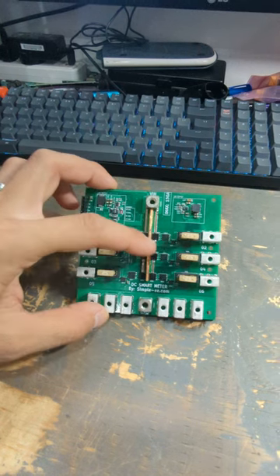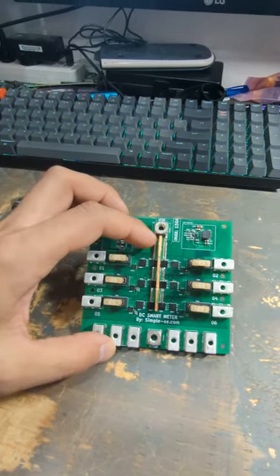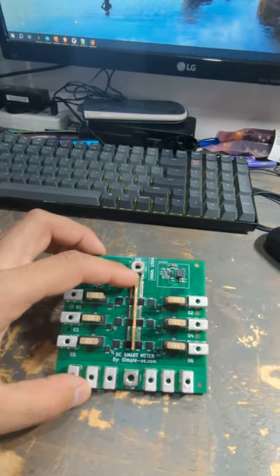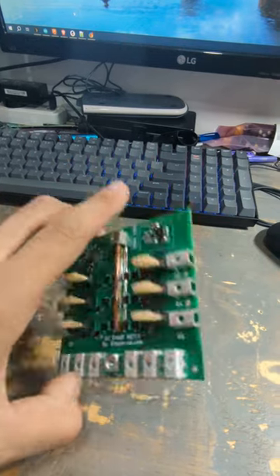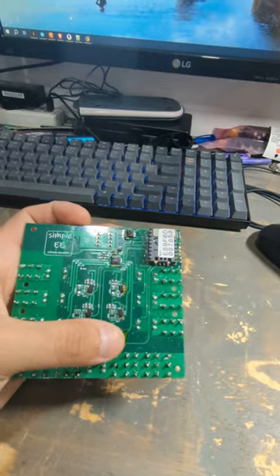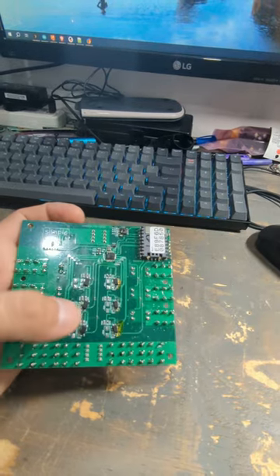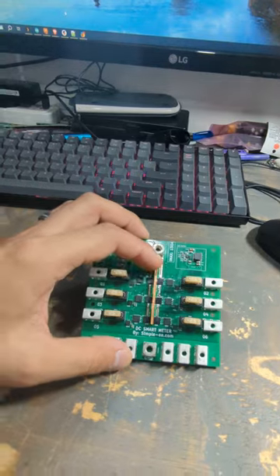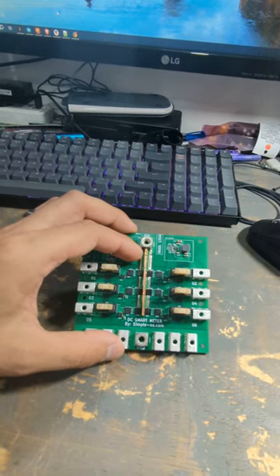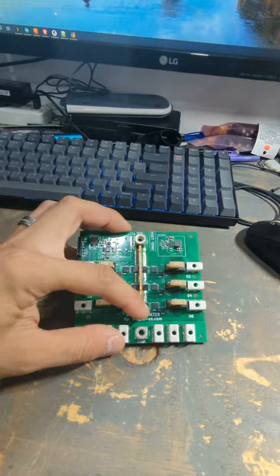I'm still working on this main leg — I did a copper bus bar but I'm working on calculating how wide and how many layers it needs. Right now this is only a four-layer board and only the top layer is using the power bus since I have circuits underneath. You can see some parts here that don't match the footprint — that footprint section will be gone, which frees up space. There's a chance I'll be able to add all four layers of copper pour, and if not I can expose solder mask and add more solder.